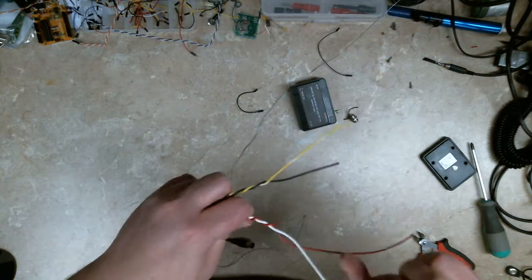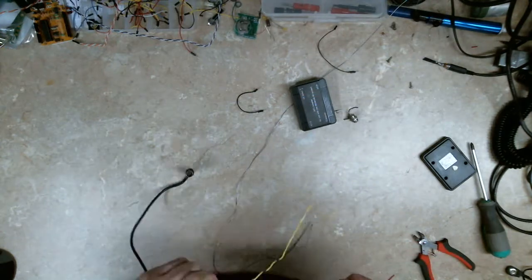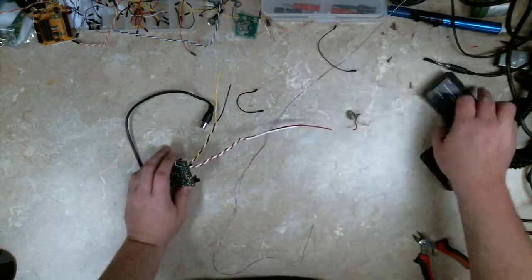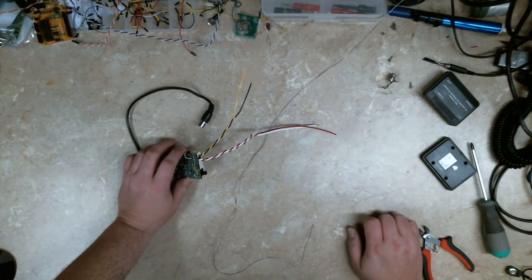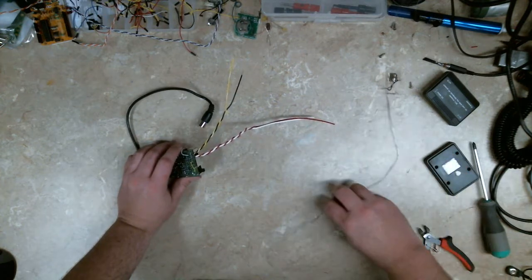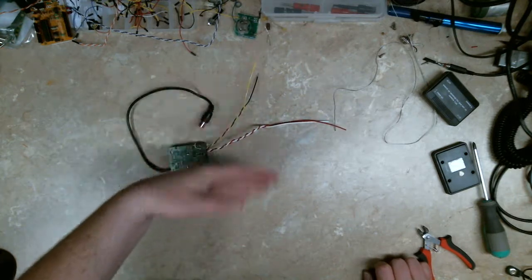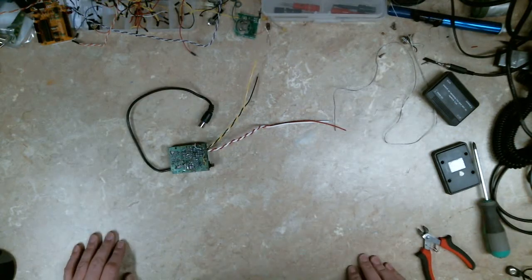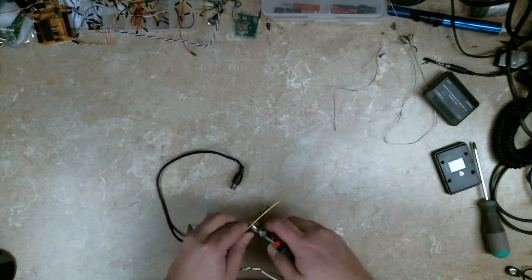If you have these wires floating around out in free space, then the video particularly will be susceptible to your hand waving past it and things like that, and you don't want that, especially when using the Arduino TV out library, because the Arduino is a microcontroller, so it's not always outputting the video. So you're going to have some televisions anyway that are going to flip out because the video signal disappears when it thinks it should be there. Changing the impedance, getting too close and far away, while the video signal's dropping in and out is just going to add confusion to the mix. So, avoid that.